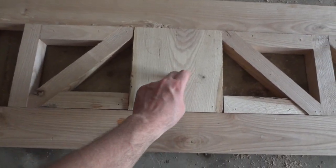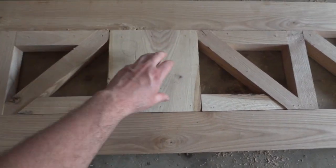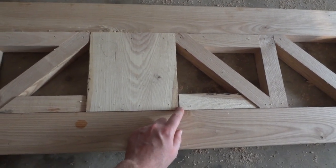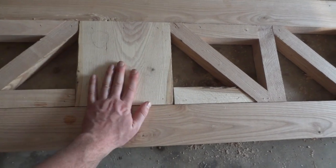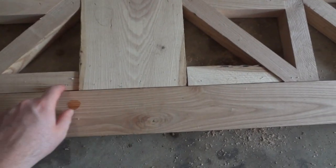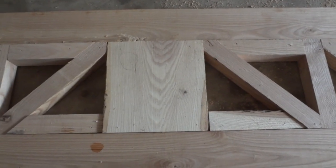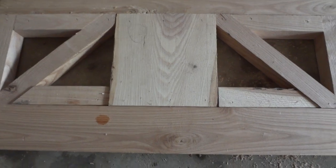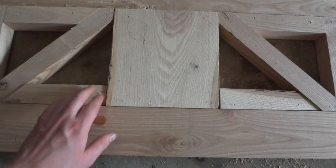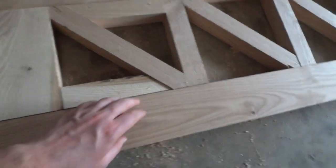But here with the axle going through, it could potentially pull this way and that way. I forgot to mention that I'm going to put half-inch plywood on both sides of this to hold it all together — so that half-inch piece of plywood would have seven and a half inches on each side. I wasn't sure if that would be enough, so along with my truss bracing I added these pieces here, so it creates a shear zone all along here to help transfer the energy.